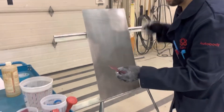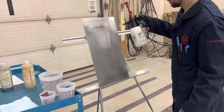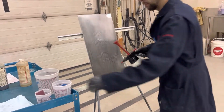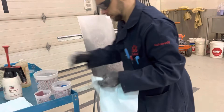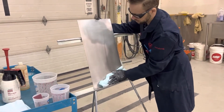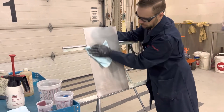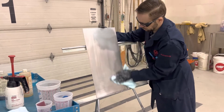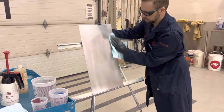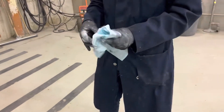When you're dealing with aluminum it does take quite a bit of scuffing. Not as much effort is required on a steel panel. Then I'm rinsing the panel clean with more solvent and will wipe it dry, rinsing again if needed to remove any oxides. With aluminum those oxides turn a dark gray or almost black color, which we can see running off the panel and in the cleaning towel. Make sure once you dry the panel that there's no beading — if material beads off, contaminants still remain.